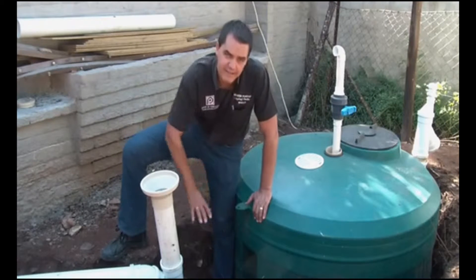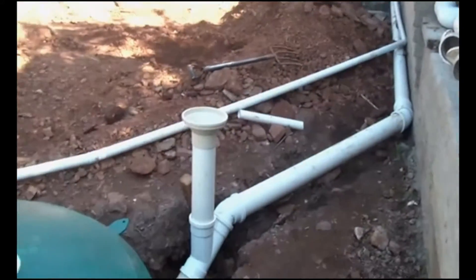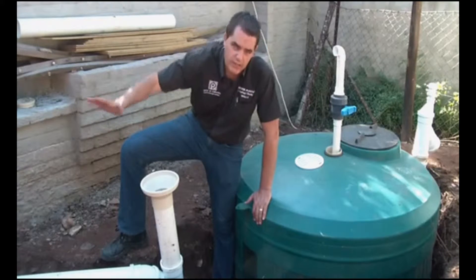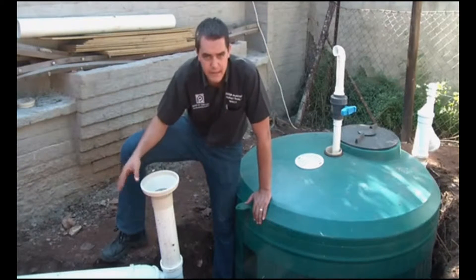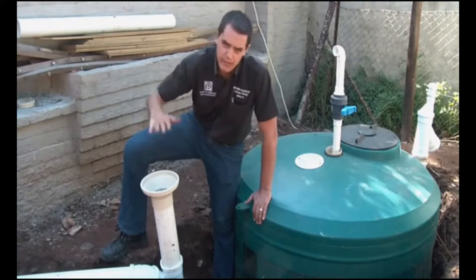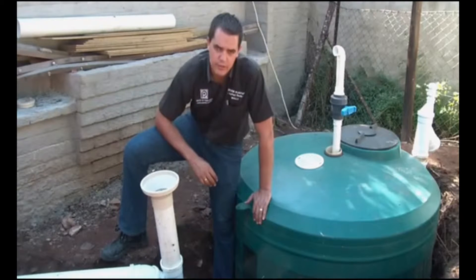What has happened now is they've connected the sewage line from our living unit into the tank, done with a very nice slope according to plumbing standards so you get a nice movement of the sludge within the pipework. The level of the toilet is just right so that you don't get a back flush of the toilet as well.